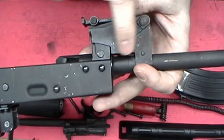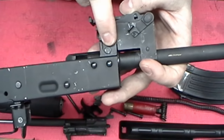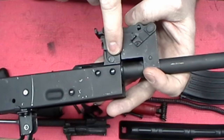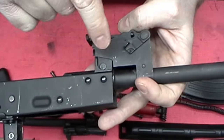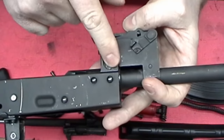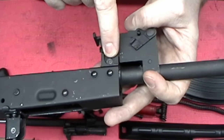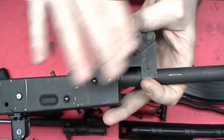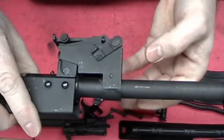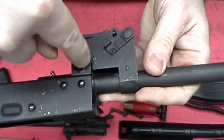Press the pin out, push the barrel in, check your headspace with your gauges. When you get it where you want it — it won't take much, we're talking just a few thousandths — then you can oversize it. Go to the next pin size. You'll have to set it all up. Run your drill bit in here; find a drill bit, reamer, or whatever you have around that will fit this hole. I think the original hole is around 275. Put it in — I have a V-clamp.